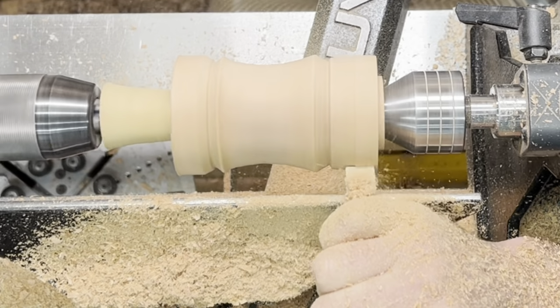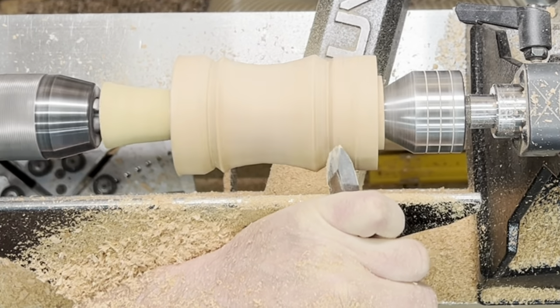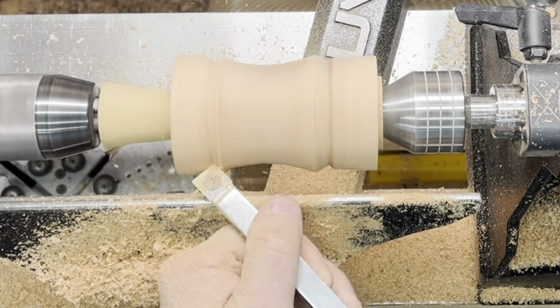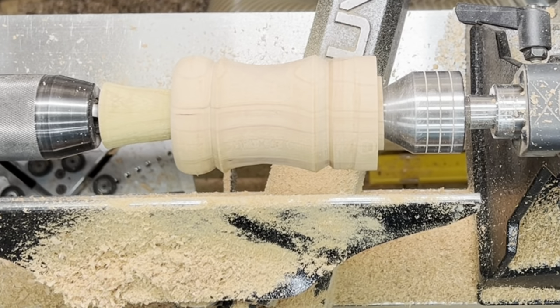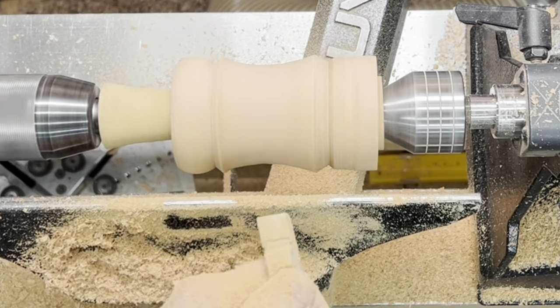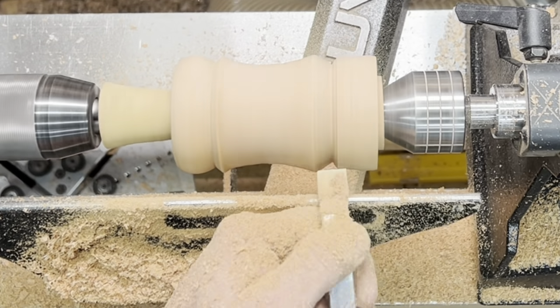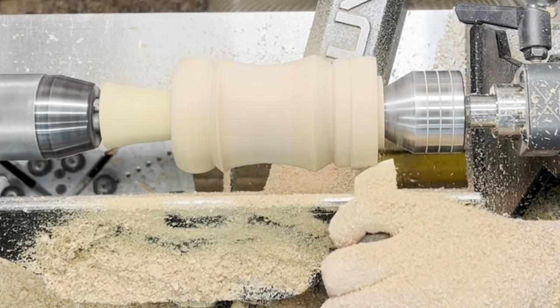I actually took the third prototype blank that I made. I decided just to keep increasing the power and time and see how hot I could get the thing. And at one point, it actually started crackling inside, and a little bit of smoke came out of it. And once it cooled off, I ended up cutting it in half. And you could actually see some of the interior wood starting to charcoal and potentially, you know, set itself up to catch fire. So just be careful when you're doing this process.